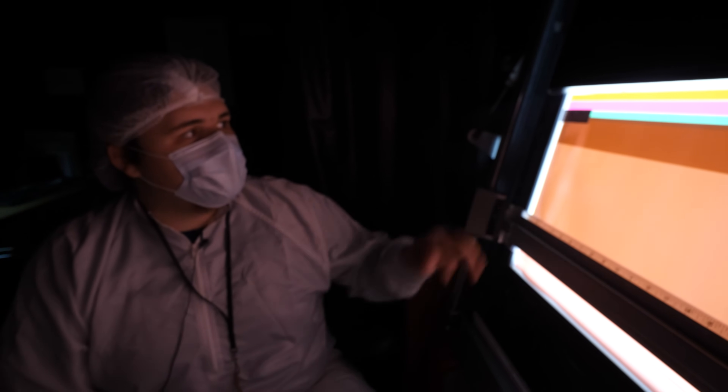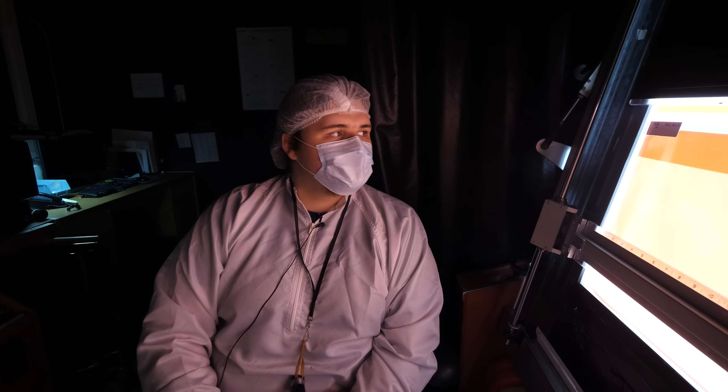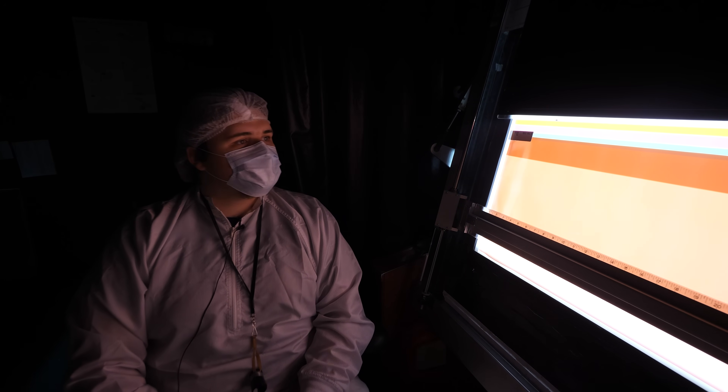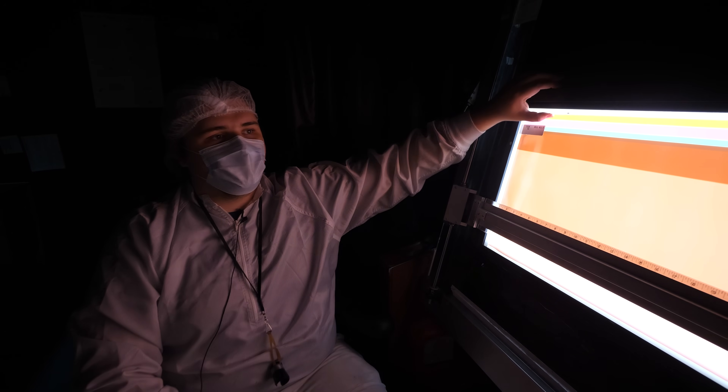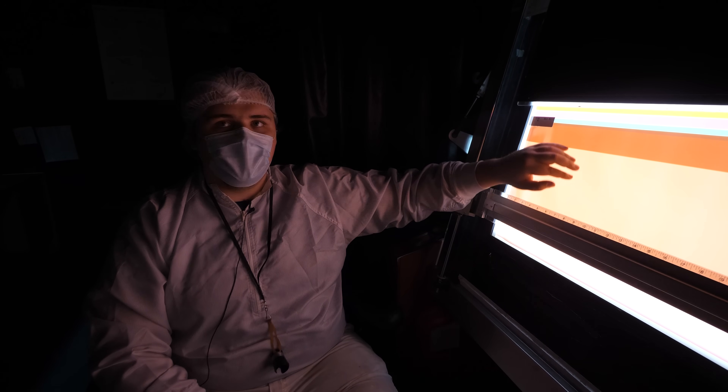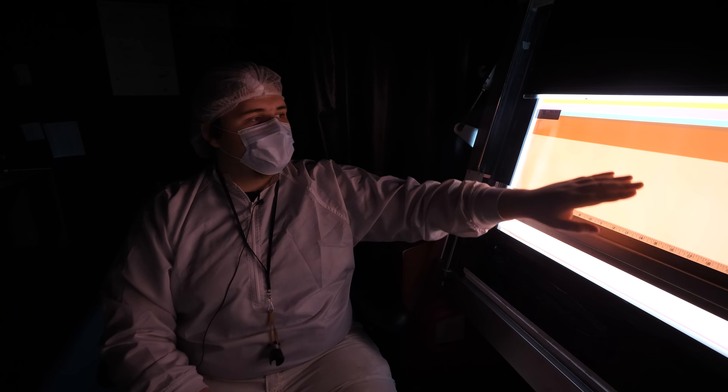Magenta is usually the color that acts up the least. Most of the time all layers look fine as long as nothing is wrong with the melt or the coat. It's only when something goes awry that they start looking a bit off. Most of the time they don't actually inspect the color strip directly — they mainly use it for density. If they see something in the normal density section, they use the candy stripes to determine which layer it's in.